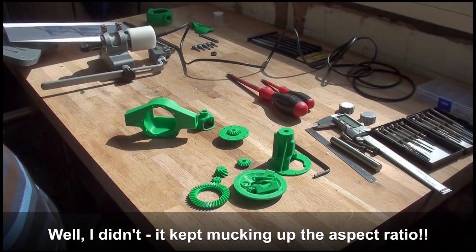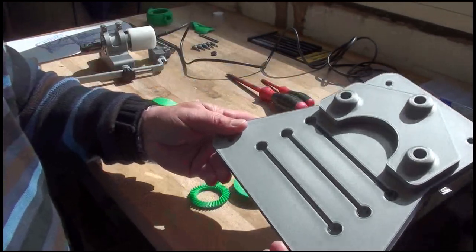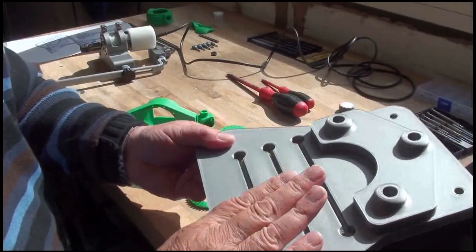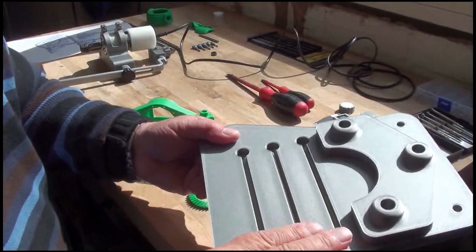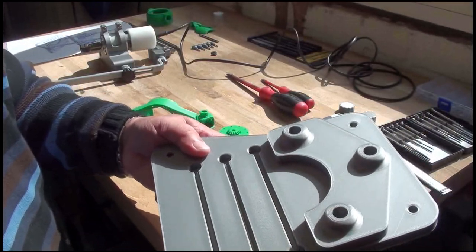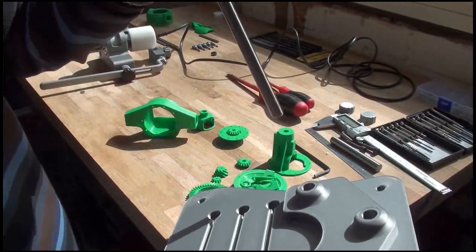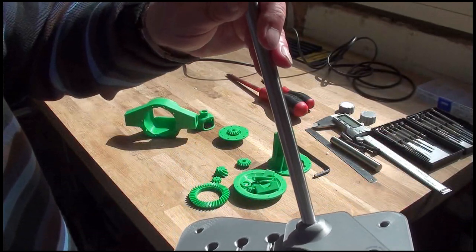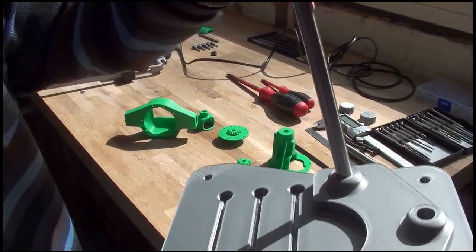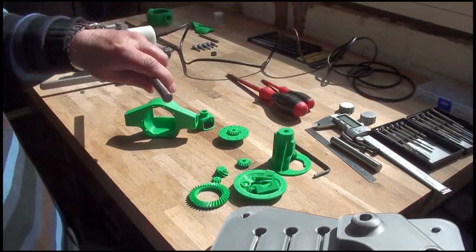design. And many hours later, there's the base printed out. Quite a nice finish. This is in fact the second one, because naturally enough the holes were undersized and I couldn't get the silver steel support rods in. They're still a bit tight, but I've printed them 0.2mm oversize, and I'm satisfied that I can press these together and they will come out quite nicely.